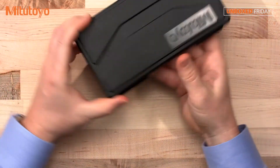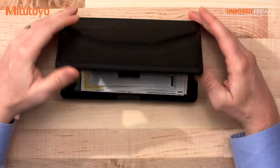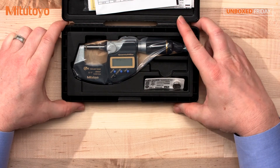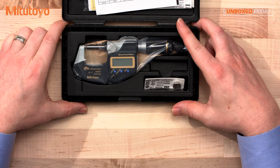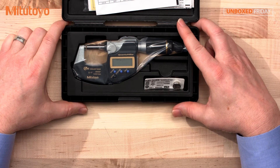This mic is very similar to our standard mic, but with one special difference: it comes with four times the speed of a regular micrometer. You're still getting the same resolution, down to 50 millionths of an inch or one micron — the same accuracy with a lot more speed.